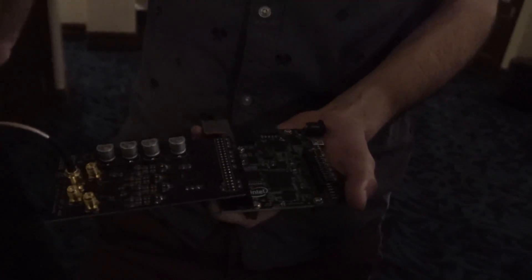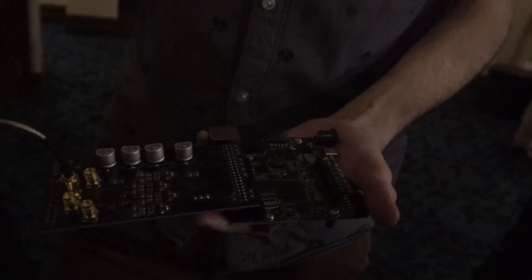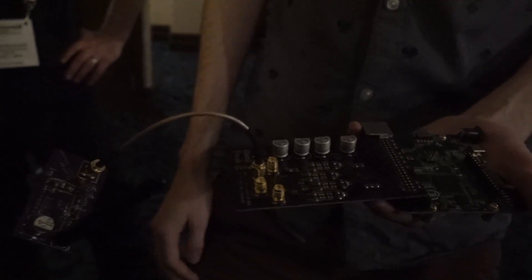This little amplifying and converting board in the middle has ground pad soldering reflow issues. Every time the amplifier is on there's a short; every time it's off, it works fine. Minor issue — you need the amplifier to make it work. But conceptually it's meant to work. The bandwidth is 100 MHz from 2.4 to 2.5 GHz. It's a quad-channel ADC — 250 mega-samples per channel, or one gig on a single channel. Saving up for a new toaster oven — typical student: money-poor, time-rich.